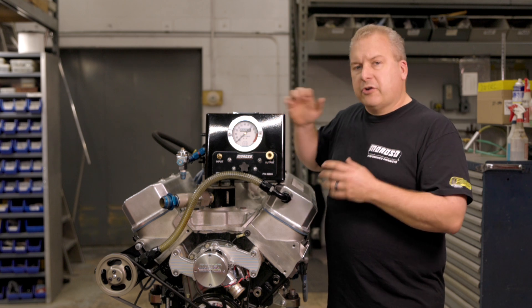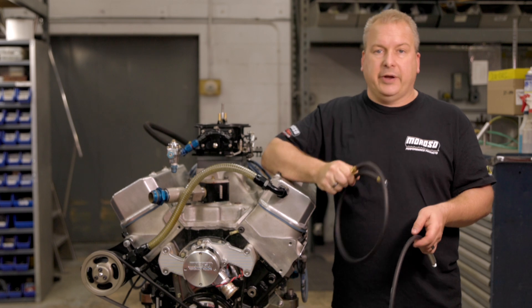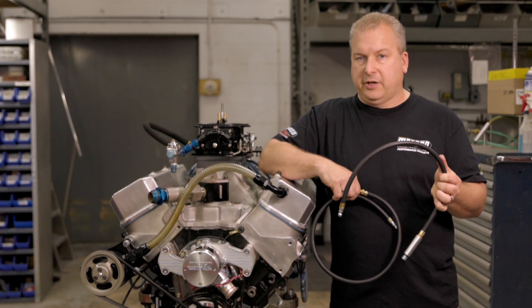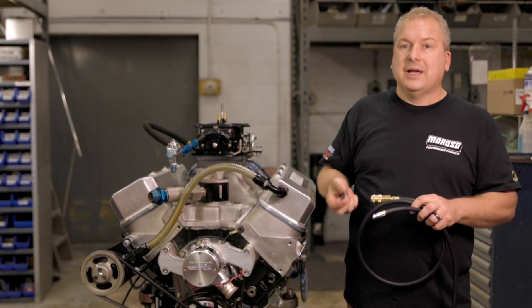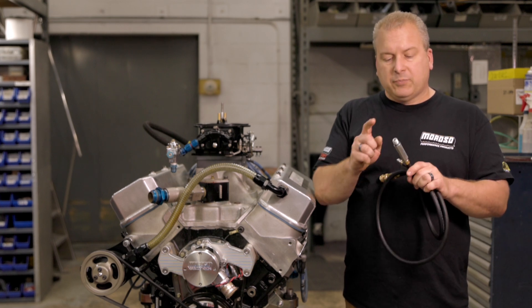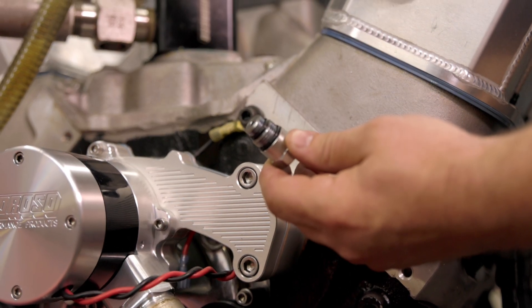It's a modern style of a longstanding component that's been in everybody's trailer and race shops. The first hose, which is a three-foot longer hose, is what's going to plug into your box and be your air source to the engine. But the most important hose is the whip hose — this is a two-foot hose where your end that screws into your spark plug is. This hose is what ultimately screws into the engine and allows you to connect up to the hose in the box. We also give you three different types of adapters for the spark plugs: a long one, which is very popular nowadays with a lot of the longer, deeper cylinder heads; a short peanut-style one for an older type of cylinder head; and a multiple-use one with a 14 and an 18 millimeter thread on it.